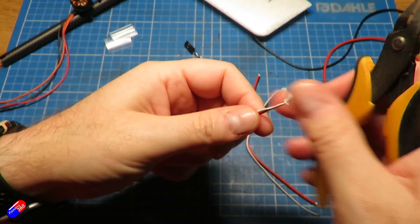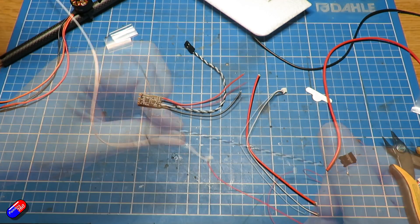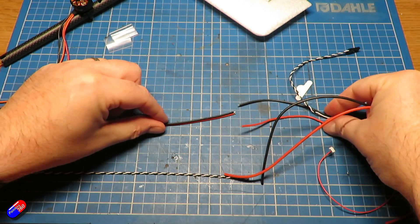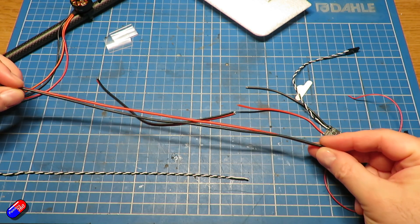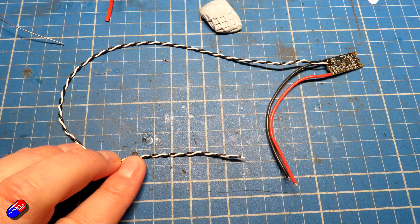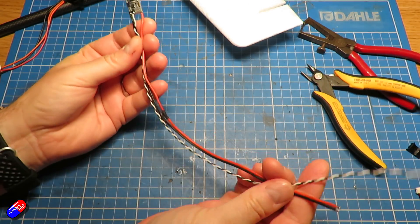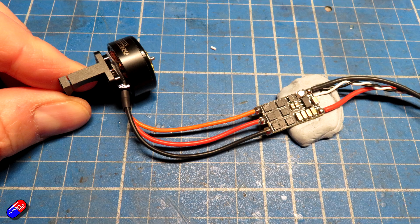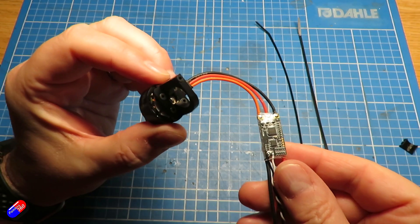I'm going to use the cable taken out from one of the LED wings — snip the ends off, take out the red core, twist it together and that becomes the signal wire to solder in place. There are also two wires I can solder onto the power connections from the ESC. With the signal stuff soldered in place and the wire extensions from the VTOL kit soldered on, I then cut the wires from the motor and solder those onto the ESC at the correct angle so it wraps round nice and neat.